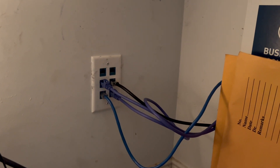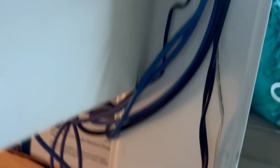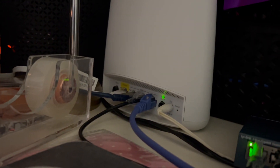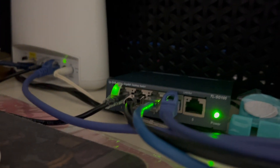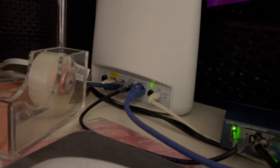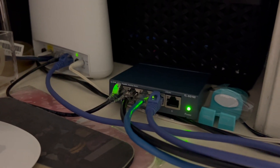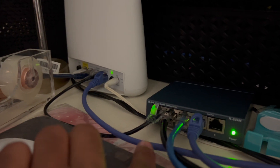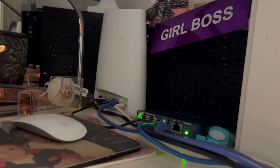Here's the final result — six CAT6 Ethernet jacks under the computer desk. I tied the cables up to make it a little neater. For my room's connection I went ahead and connected it directly into the ISP router itself, but for the other rooms — the living room, my brother's room, and my parents' room — I connected them into the switch and ran one connection from the switch into the router. We were able to get Ethernet throughout the entire house.